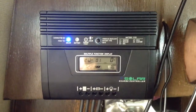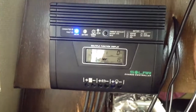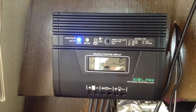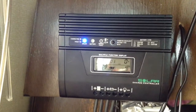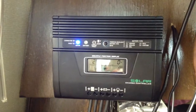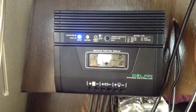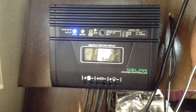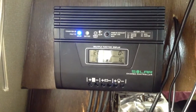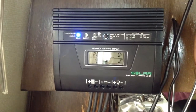One of the things that's going to make this really useful on a motorhome or any kind of mobile application is you can leave stuff on when you're away and come back, and the battery's not going to be either dead or overcharged. This is also the way to go if you have size limitations on your solar array. If you don't have size limitations, just get more panels and use a PWM charge controller.